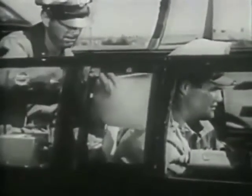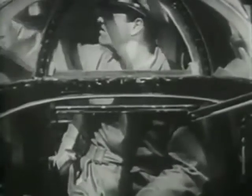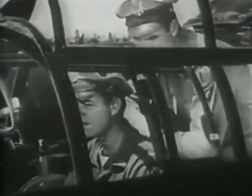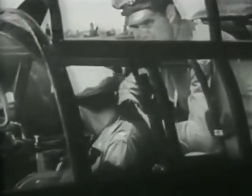Here's an old story, but a wise one: Form 1A — check and sign for red diagonals. Turn on the circuit breakers behind the gunner's seat, and make sure the gunner's escape hatch is closed and locked. From now on you are in command of the airplane. Turn on the generators, then the circuit breakers for the starters, fuel booster pumps, and lights. Look around the cockpit to see if everything is in order — nothing loose, no tools or papers to foul up the controls. Instruments okay. The controls, including the throttles, are locked — unlock and try them out.